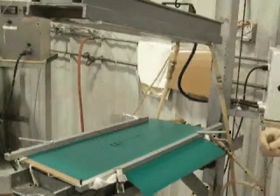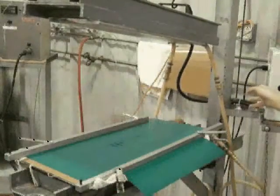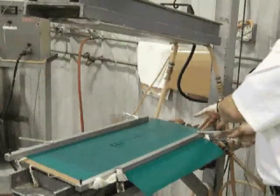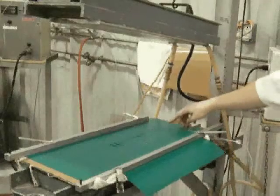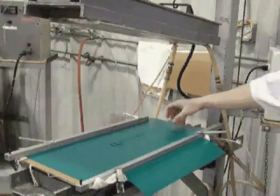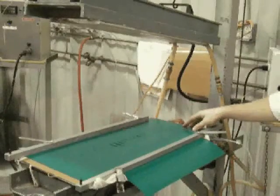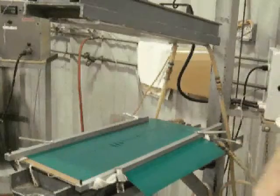The fluke lead can be placed either in the heating platen, or an alternative use is on the flow bar of the belt. Ensure that the center of the fluke lead is in the center of the heat range, both X and Y. It should be at least 1 inch from the edge of the heat range to make sure that you have the proper reading.